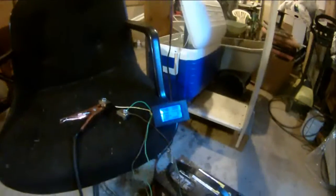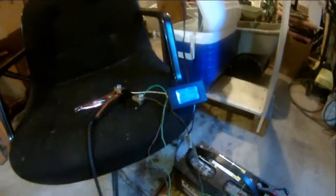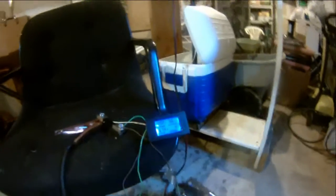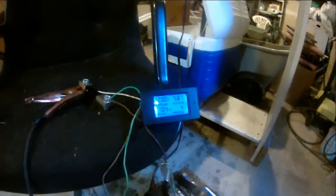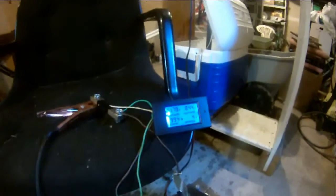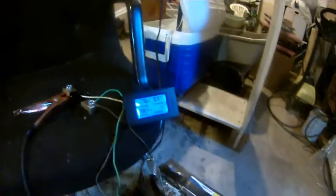Alright, let's do this one more time. It's 12.48 volts. That's one — first gear — it's 5.65 amps. Rising up to 8.4 amps on gear two. I'm going to have a flood.